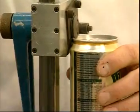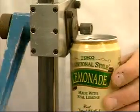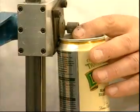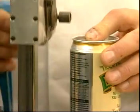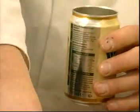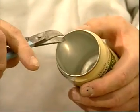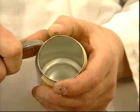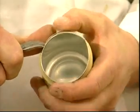To evaluate the tightness rating, use the second set of cans. It is necessary to tear the cans down. Remove the top of each can with an appropriate seam cutter and separate the end hook from the body hook. Inspect the inside of the top of the can for the chuck wall impression. If the seam is set too tight, the body wall could be fractured.